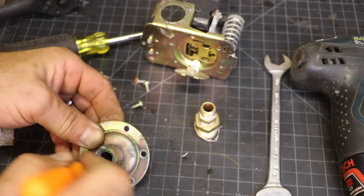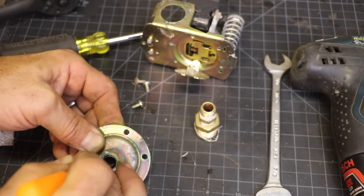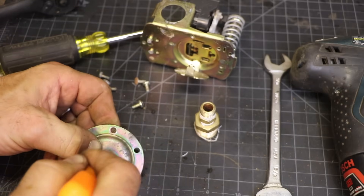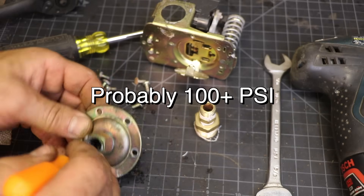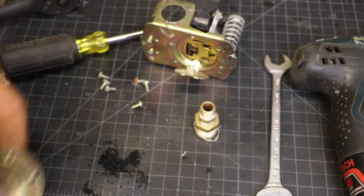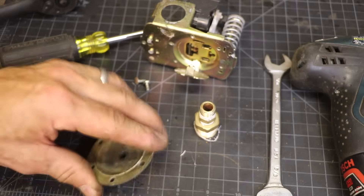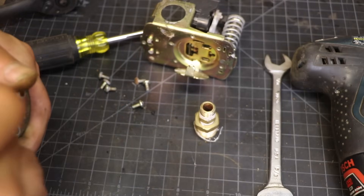I'm really lucky that I discovered this because had I not been irrigating when I turned this on — which is why I turned it on, I was trying to help the other well — if I had just turned it on and walked away, this thing would have pumped up to however much pressure that pump can generate and just sat there and run until something blew. It could have been something inside the well, like the line right beside the pump. Then the thing would just sit there and happily pump until the pump burned out. Having two wells, it's very likely I would not have even noticed. That would have sucked.